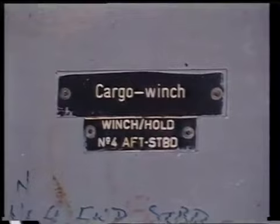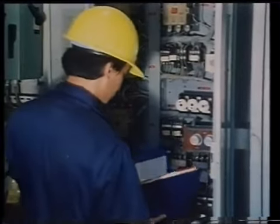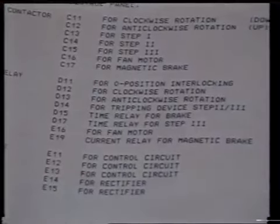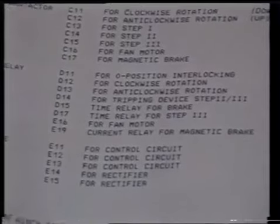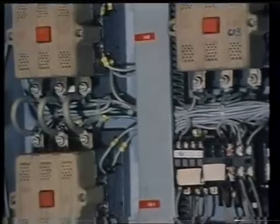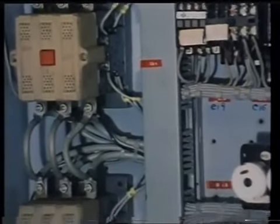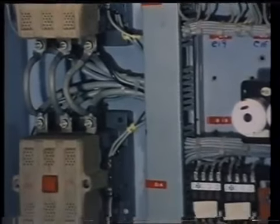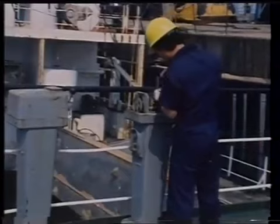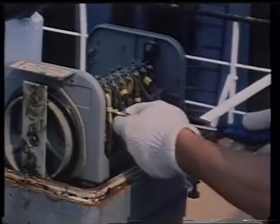The controls for variable speed motors function differently in that while connecting the supply to the motor, they alter either the resistance of the rotor winding or the number of stator poles. The control unit of the multi-pole motor has several extra contact linkages which are switched in and out very frequently as the motor is switched on and off and from low speed to high speed. These contacts must be checked and cleaned frequently. Any badly burned contactors must be replaced.